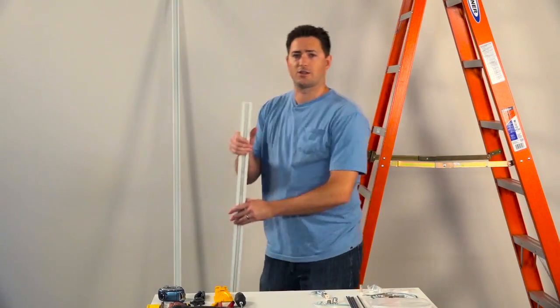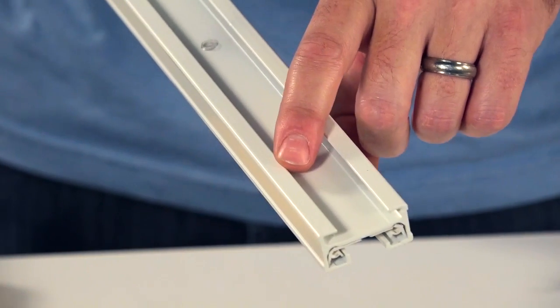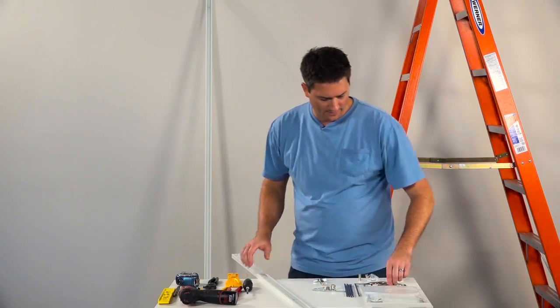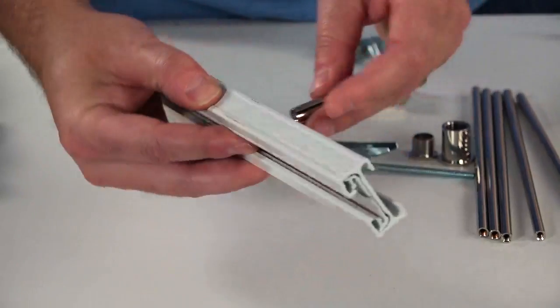This is our four-foot section of track. Some tracks have slots or pre-drilled holes, and you can also drill your own holes wherever you need them. With the slots they'll come with a connector. If you don't have the connector you can use the pre-drilled hole or your own hole. Next we're going to install the grippers into the track. These grippers have an 8-32 internal thread which come with an 8-32 screw that we can run through the pre-drilled holes we already have in our track.